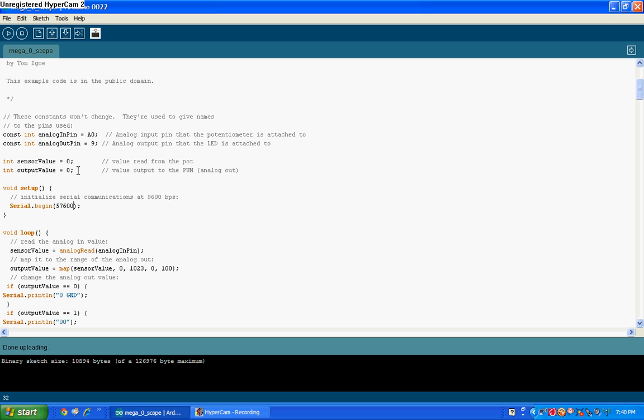The output value is basically a different version of the sensor value. This serial begin starts the serial that's sent to the computer at 57,600 bits per second. That's what I've found — it's fast enough to get the large amounts of data over to the computer, and slow enough that it won't glitch up my computer, because when I run it at the maximum bit rate the USB will allow, that locks up my computer. So this one works wonderfully and transmits all the data over really nicely.